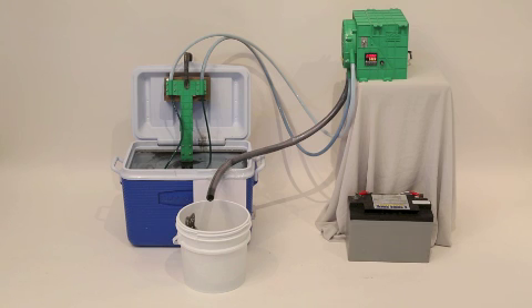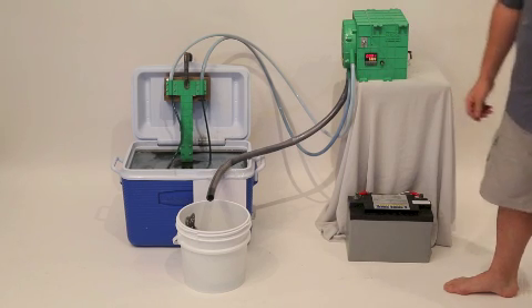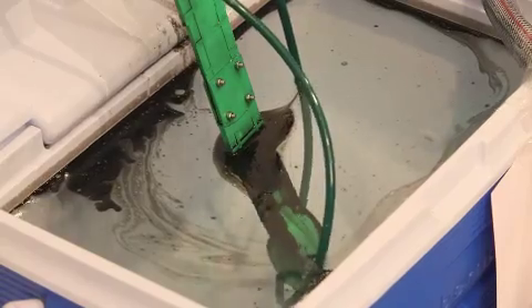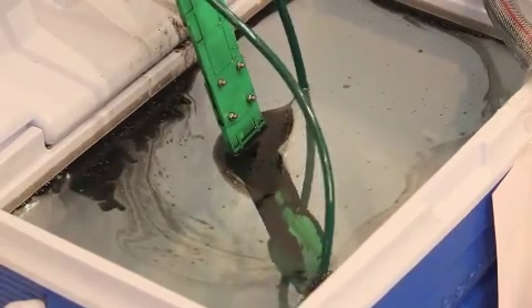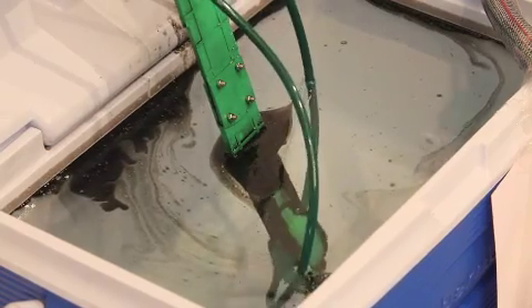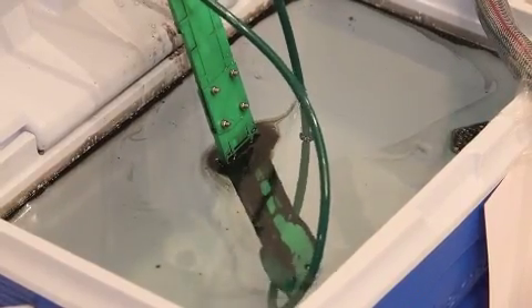Just to do maintenance — you can see on the unit itself on the right-hand side, Brett's just going to start it again after the 20-minute cycle. If you look on the unit on the right-hand side, you can just see the round wheel there. That side comes off, and there's a wheel drum that pulls this pipe up and around. And then there's a little squeegee as well that sucks the oil off the tube and returns it down the drain pipe into your bucket, as we have it set up here.